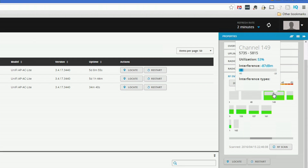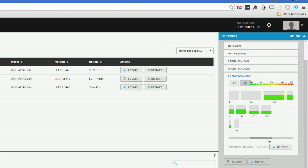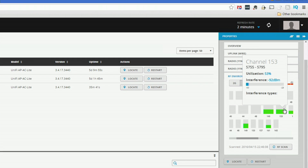I live out in the middle of nowhere, but my channel 149 is 53% utilized, so I may not want to put things on that one. Channel 48 is completely free and clear. Channel 153 is 53% utilized but not by Wi-Fi — it's picking up other radio sources. Wi-Fi works over unregulated bands, which means Bluetooth, cordless phones, game controllers, and a lot of different things use these frequencies. The access points can go out, take a survey of their immediate environment, and you can then set which channels they operate on. You can also just default to auto.